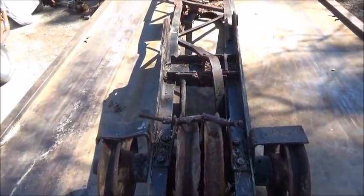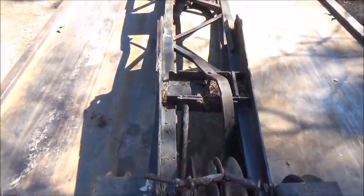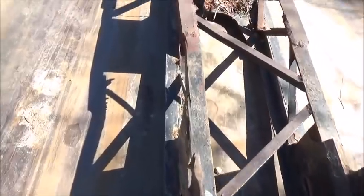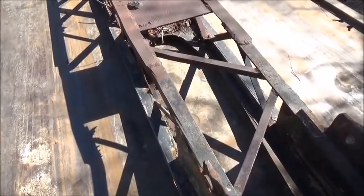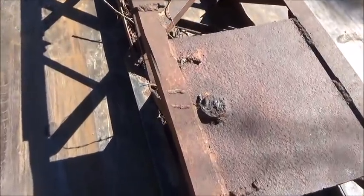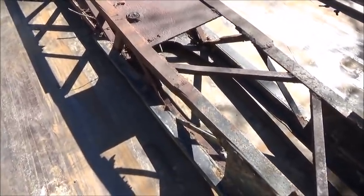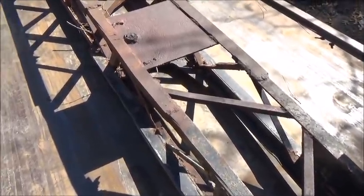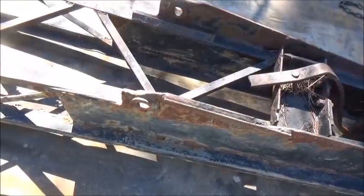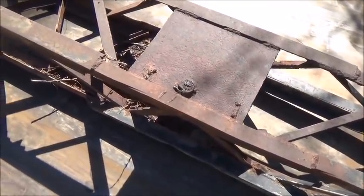The boom is twisting — nothing about this thing is very good or straight. We're going to go ahead and get to cutting. There's a bend right here with a lot of it. I've got an angle iron cutter that I picked up — that 144-pound piece a lot of people didn't know what it was. It's made to shear three-by-three-by-quarter angle, and the biggest thing we're working with is two-by-two-by-quarter, so it should shear all of our angle.